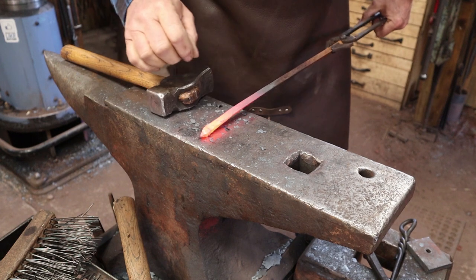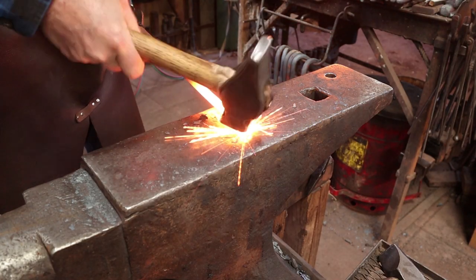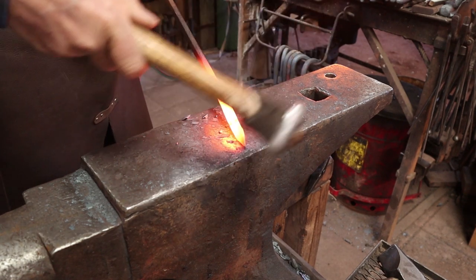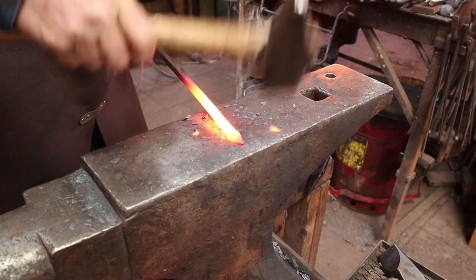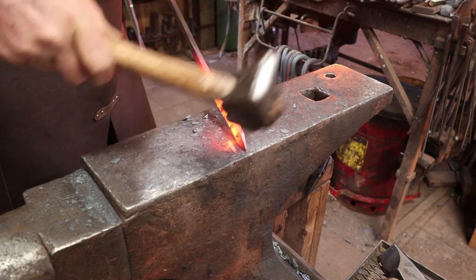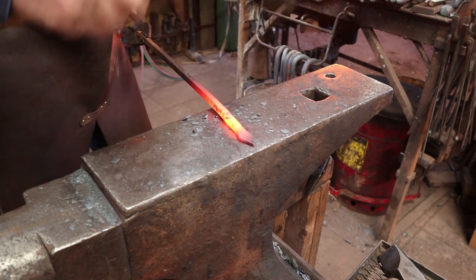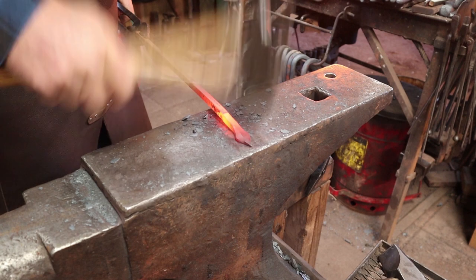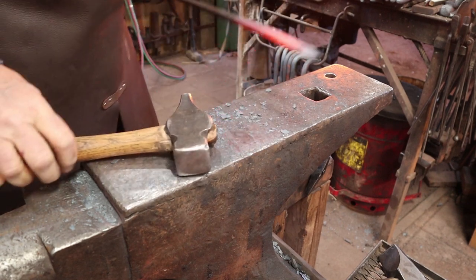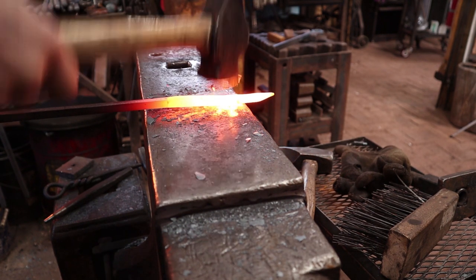This is my setup for this — I'm going to spread it, but I'm not going to shoulder it. I want this one to kind of be in the middle of the bar. I'm going to go ahead and spread it some with the cross peen, then start drawing this bar back away from there and thinning it in one dimension, leaving it three-eighths in the other dimension.